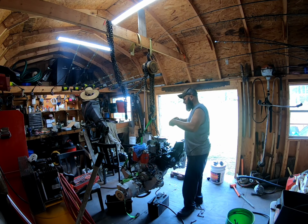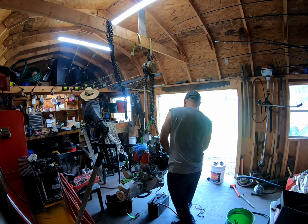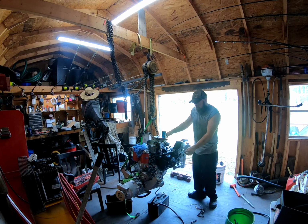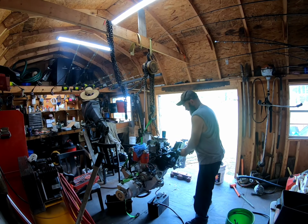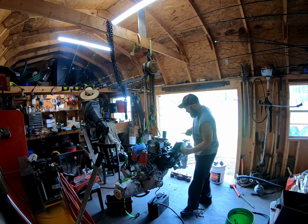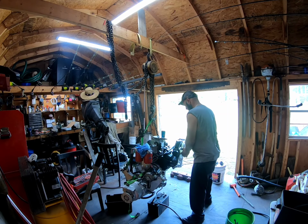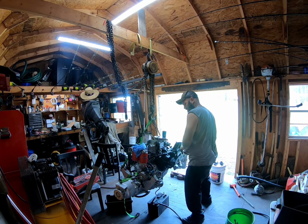And like I say, it is probably the worst thing about putting a motor in a boat. Shaft lined perfectly up. If you don't get it lined perfectly up, you get a vibration in the boat. Nobody wants a vibration in the boat. Plus, this boat has brand new shafts, brand new propellers, all that stuff is brand new on it. Vibration means something's not right, and it'll just tear that stuff up.